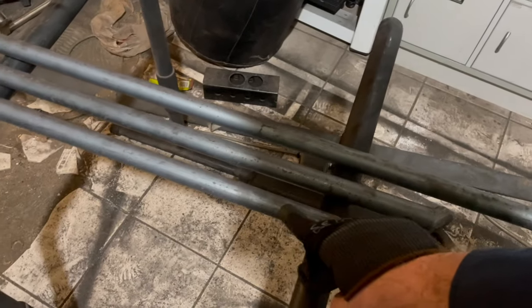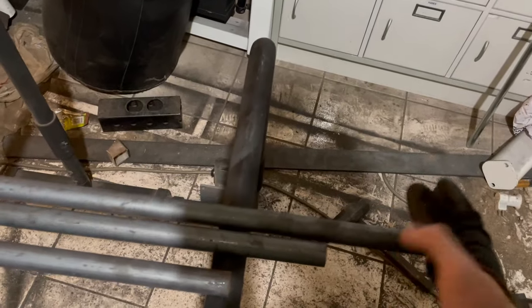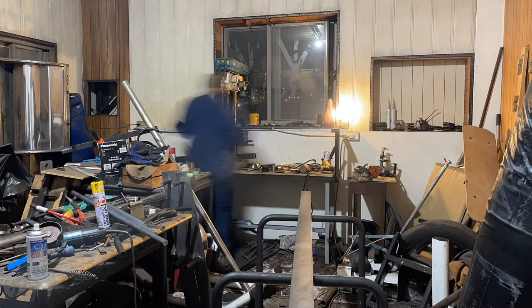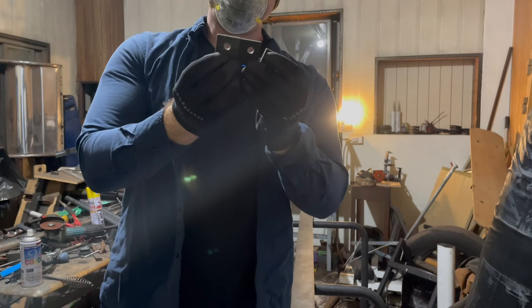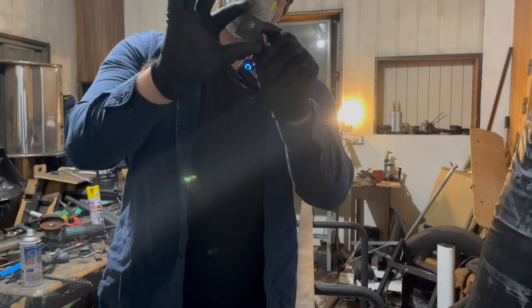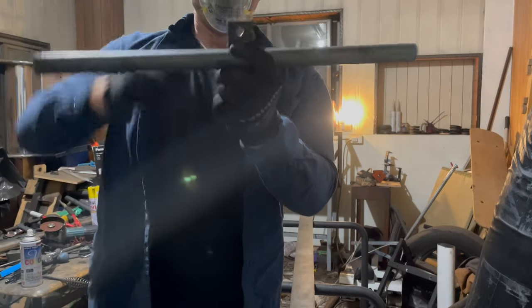I cut three different lengths — 51 centimeters, which is what was left over, then 75, and 100. I'll primarily use these as straight bars, but I'm going to put a little plate at the end of every one so I could also get a wide neutral grip on each bar if I want. I cut these out of some quarter-inch flat bar — drilled three holes side by side and then cut them out. I'm going to expand the holes a bit larger, smooth and round the edges so they don't catch or cut you, then weld them directly onto each bar as eyelets to hook the cable to.